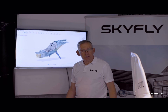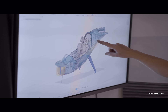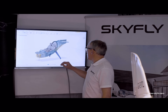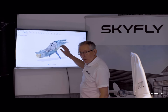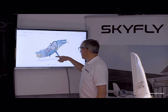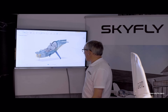The Axe has two battery compartments, one in the nose and one just behind the pilots. They are a maximum size of 24 kilowatt hours each. It's possible to substitute the rear battery packs with a hybrid generator, which would be run by fuel carried in a tank under the seats — located on the centre of gravity so that doesn't change the balance of the aircraft.